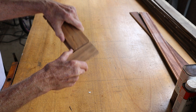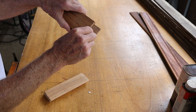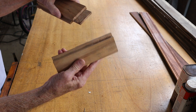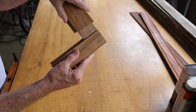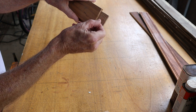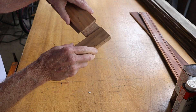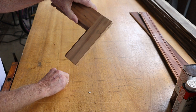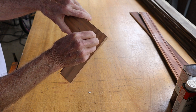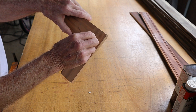If I want to take it apart this way, it's possible that the nail will rip out of the grain. If this weren't a blind mortise and tenon and I wanted to remove the tenon by sliding it out, having a pin right here is going to want to rip out all of this on the side of where it's pinned. So it becomes essential to remove any pin dowel that is through the tenon in order to disassemble this without making a lot of damage. And so I'm going to show how I went about that in this video.